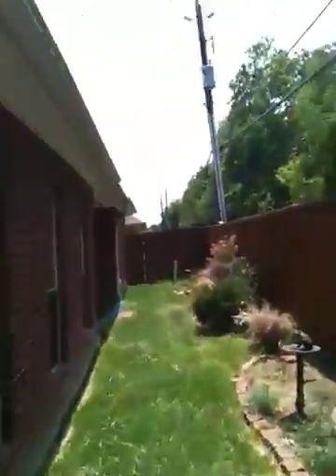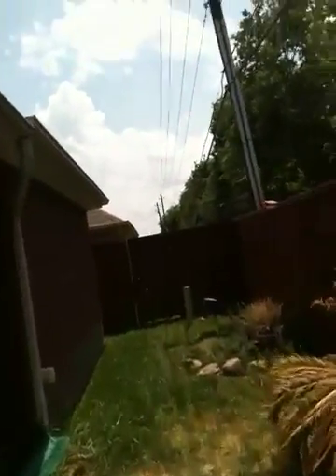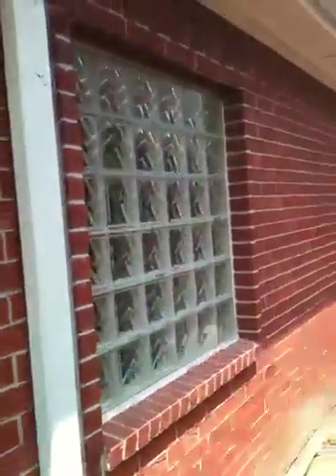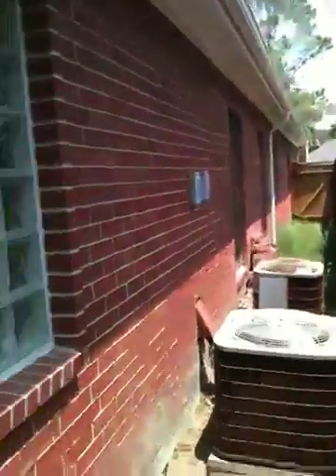The customer did not have a plot plan or survey, so this is our best bet for placement. On this side it looks like you have utility lines, probably an aerial easement, and also a utility easement. We would like to put it over here, but without the plot plan we've got the utility box here, which shows with the poles that it's on the utility line. At the back of the house there's nowhere to put it — there is a block window there, but it's a blocked window that cannot be opened.